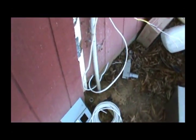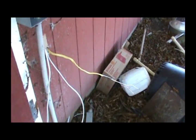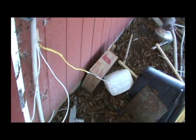I was going to go ahead and run the other circuit, but unfortunately right across here — if you can see the nails — there's a board that goes all the way across in between the studs, and that's prevented me from going over the top and down like I wanted to. This is not as easy as I thought. It's been a couple of hours just getting these two new wires run, and I found out that since I do have it on a 30-amp circuit I should really have 10-2, but it was on 20-amp and kept tripping — I think it's just a bad compressor motor.